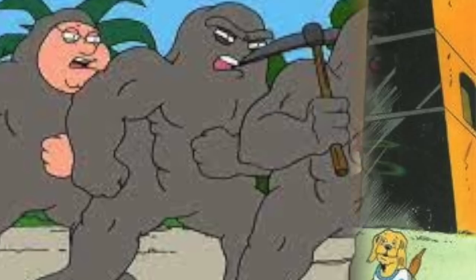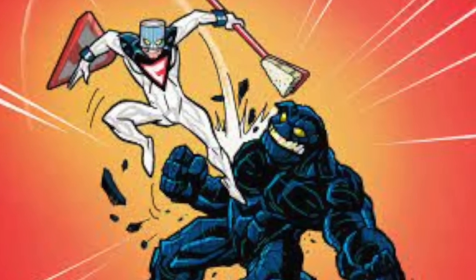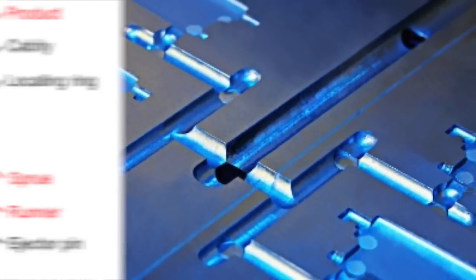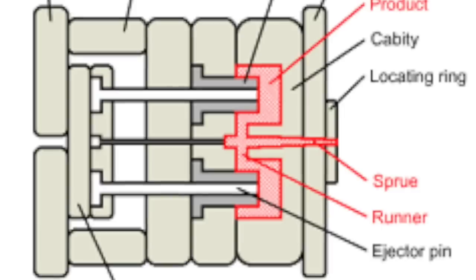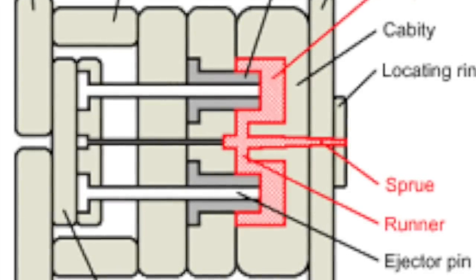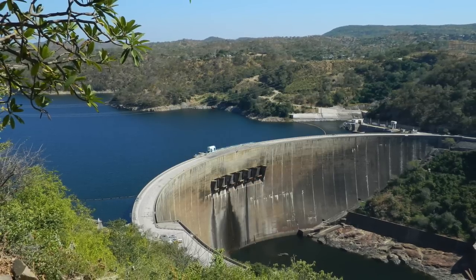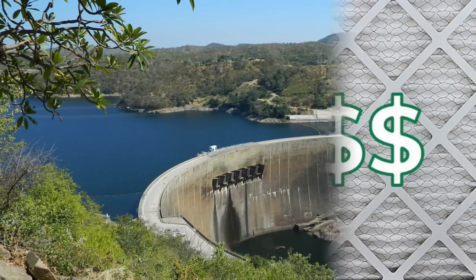It's all about cavities — and I don't mean cavities in your teeth. I mean the cavities inside the mold. If you have more than one tool being used, you block the cavities that are not being used. It's like damming a river, except it's a small piece of metal blocking plastic from flowing into other parts of the mold, blocking out the parts you don't want to make.